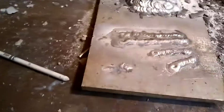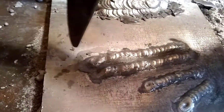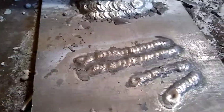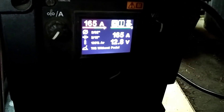I'm going to get a little bit more cleaned up and see what's going on here. The side is a total pain. Here are the settings — right here on DC, 165 amps. It's a pretty thick piece of aluminum, and using 100% argon.